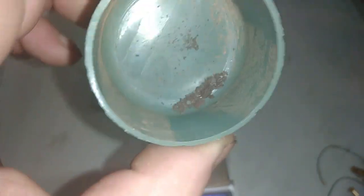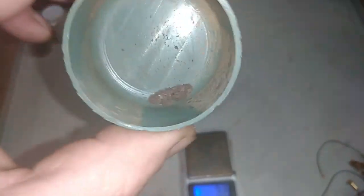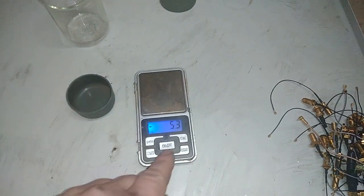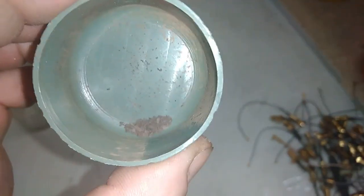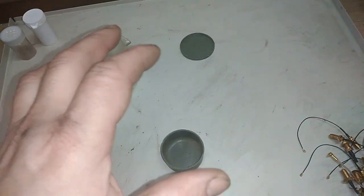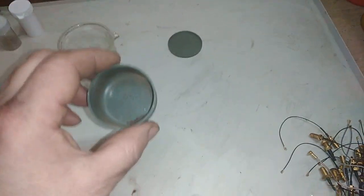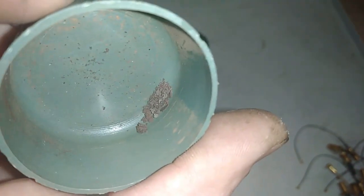It's not bad. This is a little bonus. But is that worth it? Well, it depends on the process. I think with my mix of acid, it's actually worth the trouble, because you use just a small amount of sodium nitrate and sulfuric acid, which is cheap. You can use battery acid. You don't need to use pure sulfuric acid. So definitely, I think it's worth it. So from 1 kilogram of leftover material from my IC mix, LED diode and transistor gold recovery, from the metal I harvested this 0.2 gram of gold.